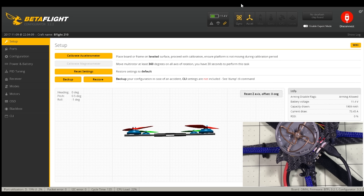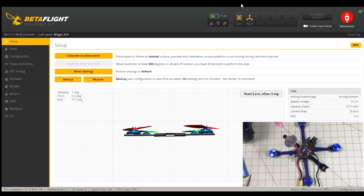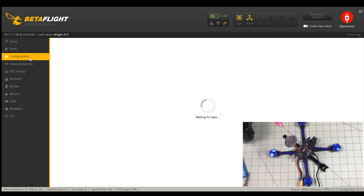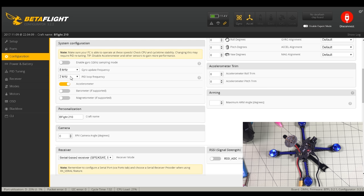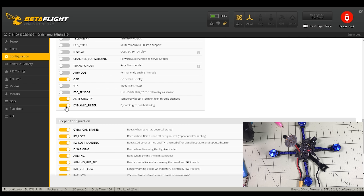I found an antenna to connect to make sure I didn't burn up the VTX while the battery was connected. I had to use the old standalone version of BLHeli. I'll show you my settings: I am on UART 3, which is the default here — same as the previous video linked at the beginning. DShot 600 is set, I turn on motor stop, named it, and I'm on 8000-2000.